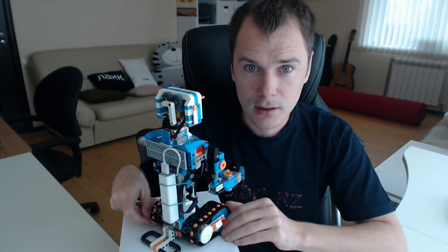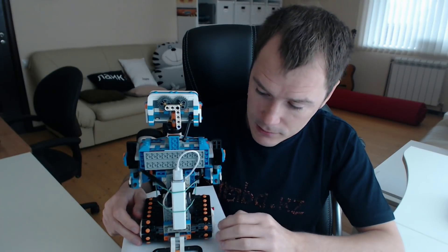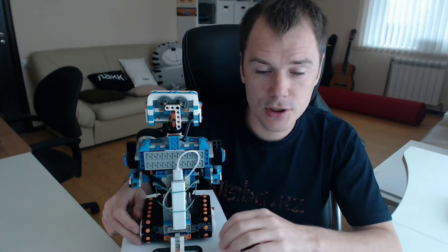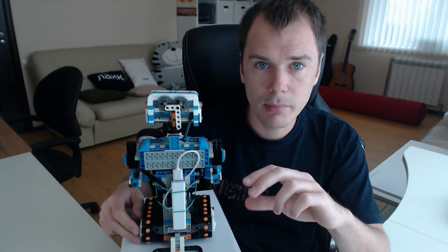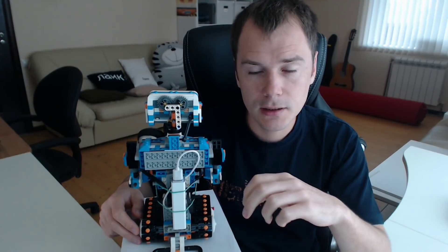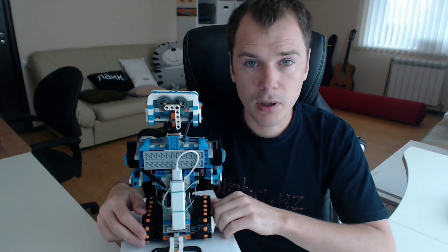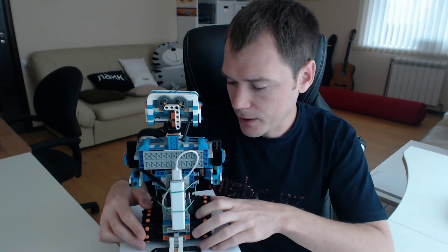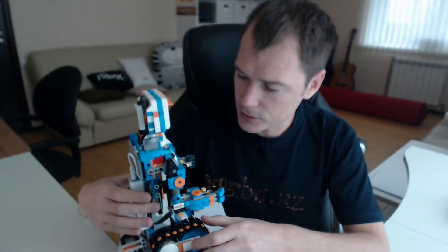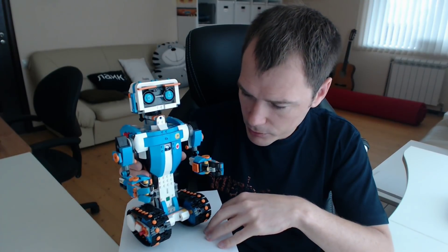One optimization I had to do was also to change the power source, because I didn't want to spend too many batteries. I attached a USB power bank and without breaking anything, I just used existing holes in the power block for the batteries to put two small wires into it and get power from the power bank. The only problem is that the original voltage is nine volts and power banks give only five, so the only side effect is a blinking LED that always says it doesn't have enough power — but that's okay.